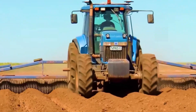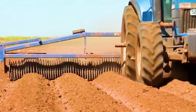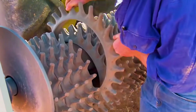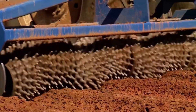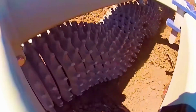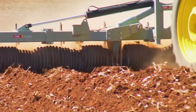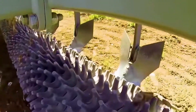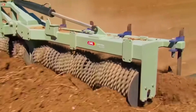The first time you see a plow like this — a column hung with empty round discs, the edges of the discs filled with saw teeth — the tractor pulls the column across the field and the empty round discs naturally fall up and down on the ground, operating without electricity. They roll freely, breaking large clumps of soil into small pieces. Since only the surface soil could be broken, designers added a row of plowshares behind the discs to enhance soil plowing efficiency.